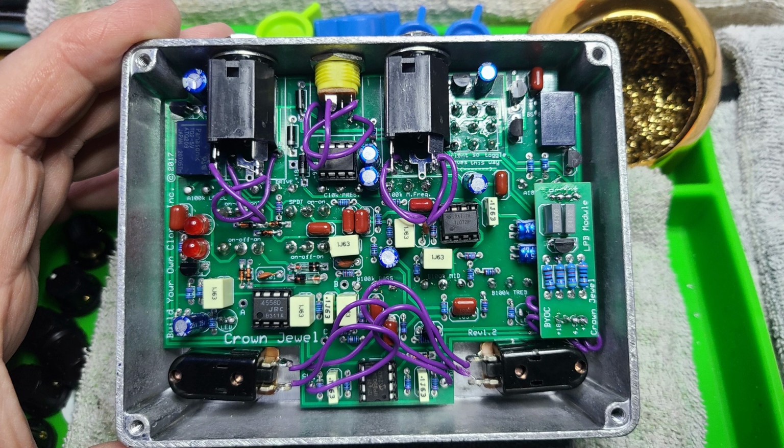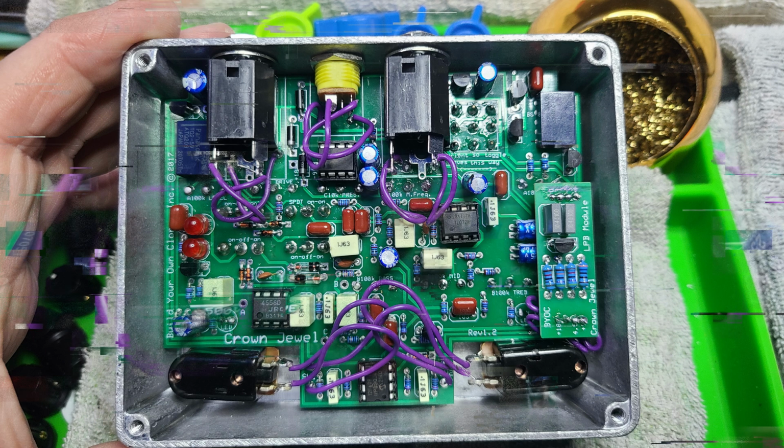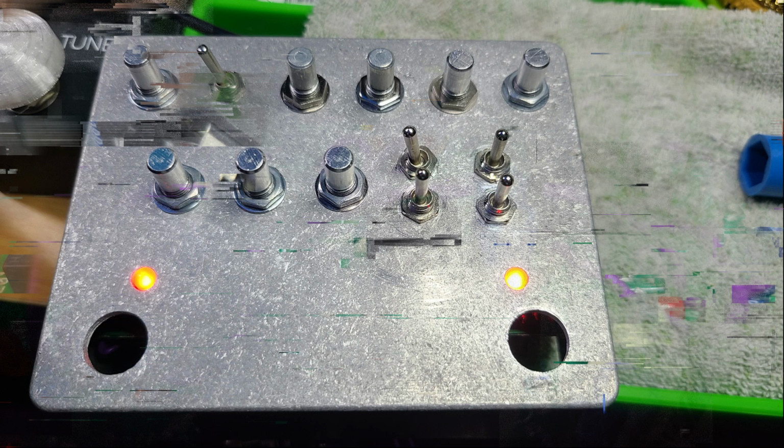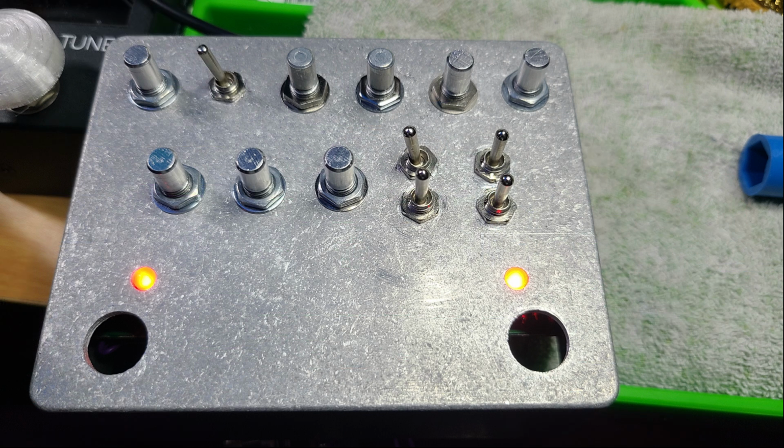And I thought, oh, this is great. And then I ended the video and said I was getting ready for audio. And then I go to start the session, plug it in, and I've got no signal going through from my guitar through the pedal. It lights up, but there's no signal. Well, I ran out of time. I thought about it long and hard and went through the instructions again. What could it possibly be? In this case, like I stated in the video, the input jack and output jack, one of the legs that deliberately aren't soldered were touching a place on this printed circuit board that was soldered, and it completed a circuit and was grounding out, so it didn't work. So I bent those, great, everything lit up, awesome, but the sound, that's where I'm talking about. At that point, there's no sound going through it.